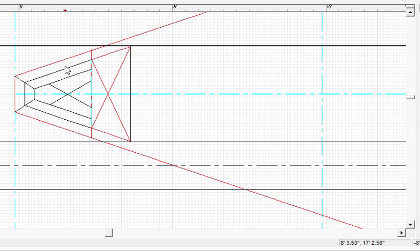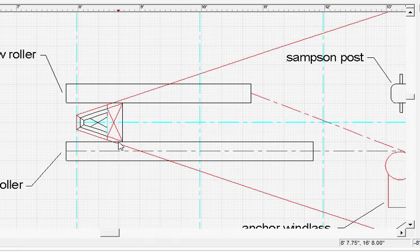And then it will be, of course, finished bright with spar urethane. And so, great opportunity for water to get in here. So, the Doug fir, after mahogany, I'm not really sure yet, because I know there may be a difference in the coefficient of expansion if I use two different materials here, which could make these joints crack, and I don't want that. So this may end up being a solid piece of African mahogany, but I'm not sure. But anyway, that's how the bow will be finished.